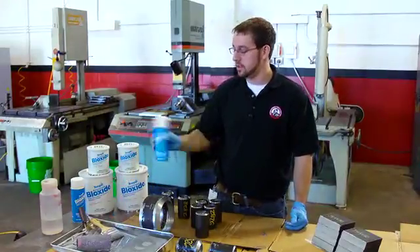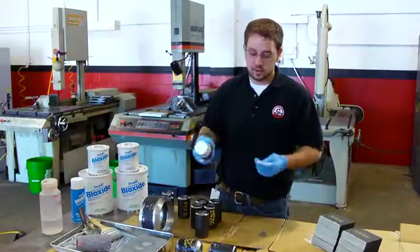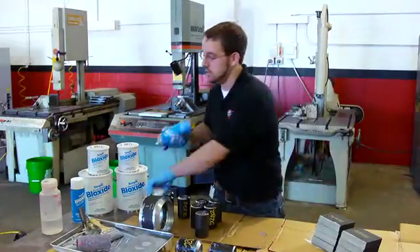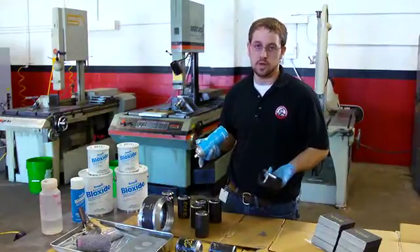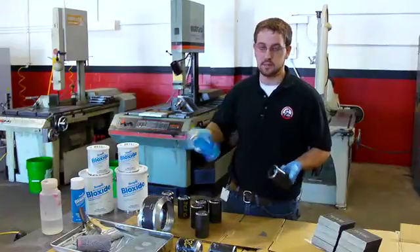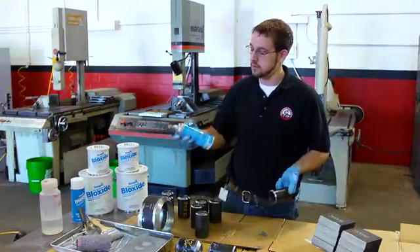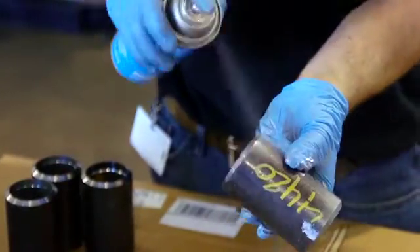The aerosol application is quick and covers a large area. This works really well for when you're shipping parts and you're worried about corrosion in shipment if it's not in a watertight container or can be exposed to atmosphere. It's going to coat it about the same — just a different delivery method.